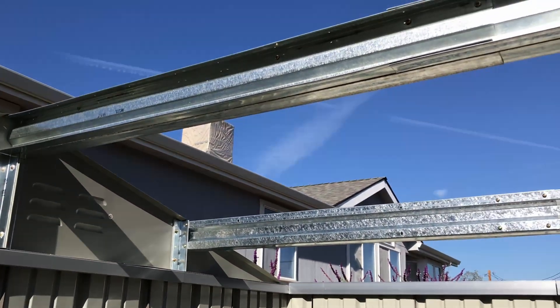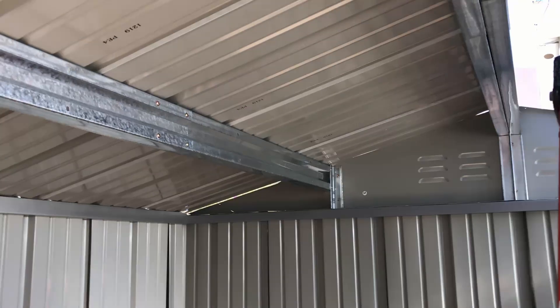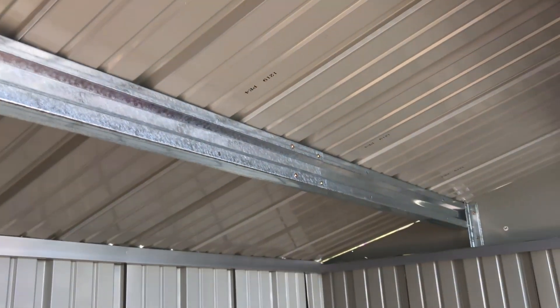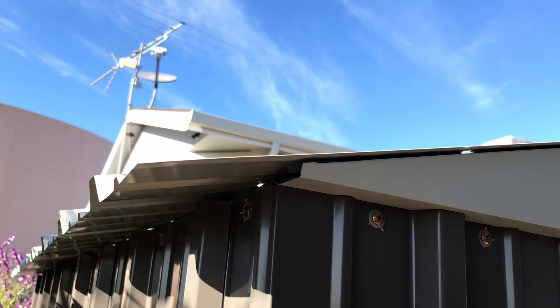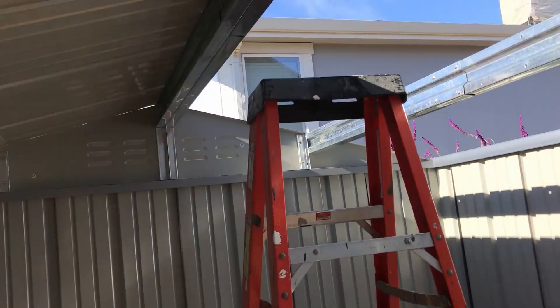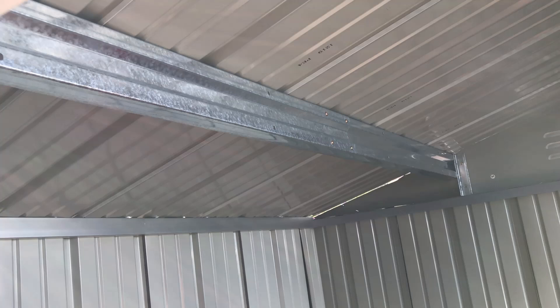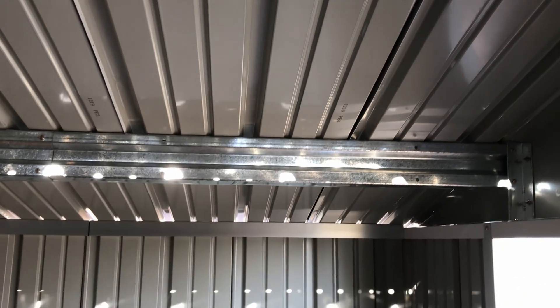I've got all three roofing supports in, tightened up, and ready for the roof. I put one half of the roof on with the screws left loose just to make sure everything made it all the way down and all the holes aligned. The shed looks pretty square, so I tightened up the screws and got the other side on. All screws are tightened down. Next step is the trim around the outside edges. I've got all the roofing done — the strips around the edges and the little plastic caps are all completed, so I'm going to start working on the doors.